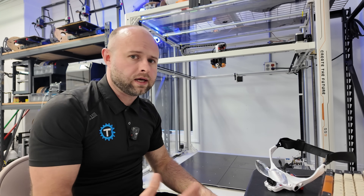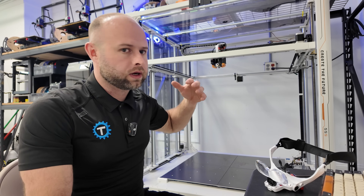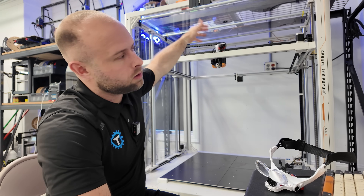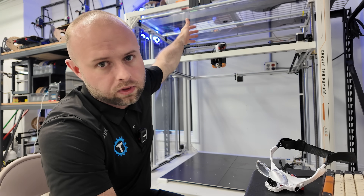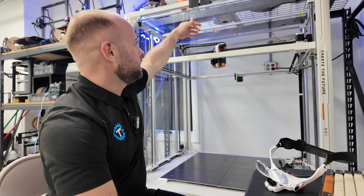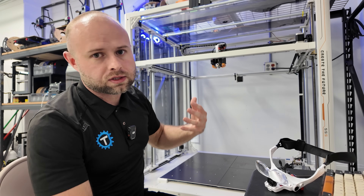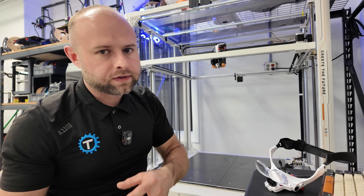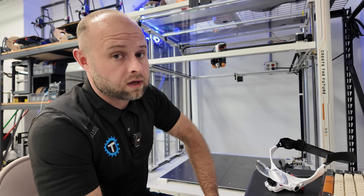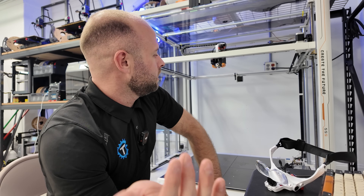An EBB 42 would make things run so much better. After many many hours of work today, I loaded Katapult onto the Kraken as the bootloader and flashing utility to get Klipper on there — had tons of issues but I did get it on there. When it came to flashing Klipper onto the tool board though, this obviously isn't one of the standard examples you can pull from. On top of that, the boot button to put it into DFU mode to flash it is built into the printhead in such a way that you can't get to it — you have to take it off, press the button while it's all connected, do your flashing, then put it all back together. I imagine Joel or 3D Print Nerd or anyone else who's done the Orange Storm conversion just did it with the stock Elegoo board.